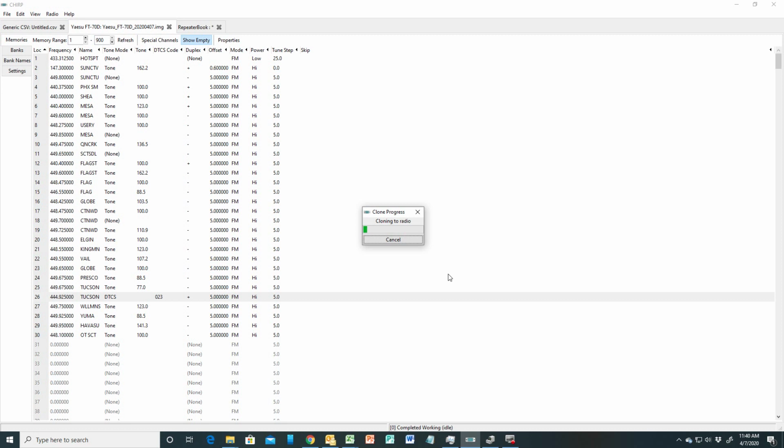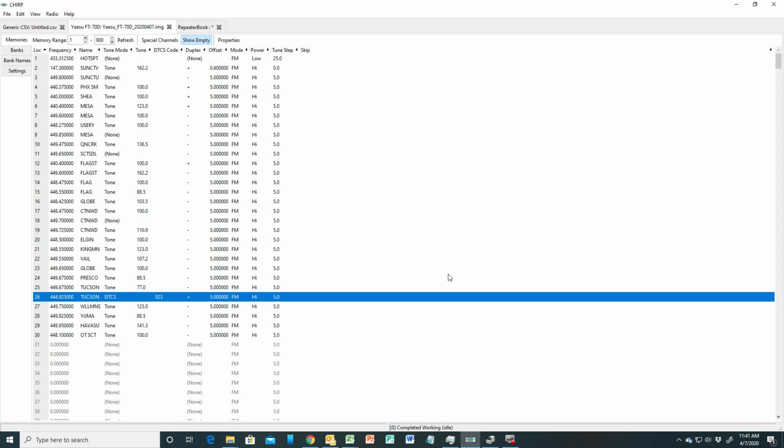And as you can see, it's going through the cloning process. It's writing to the radio, and so it's writing in all of that information for all of the channels, even if it's, you know, zeros and nones and so forth. So I'm just going to wait for that. So now the write to the radio is complete. The radio is turned on. The screen has illuminated. And so I think I'm done. So at this point, I'm just going to go back to the radio. I'm going to turn it off and turn it back on without the data cable connected. And I should have my channels there in the radio.